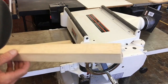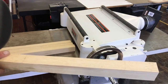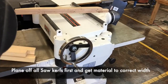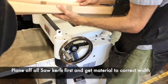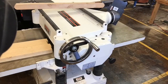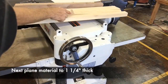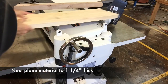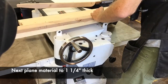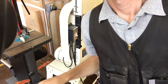As you can tell, all of these are still pretty rough. So we're going to run these through the planer and get them all to the exact same dimension. First thing you're going to want to do is plane these to width. That will allow you to draw your template on there. Notice I'm checking the template to see if it's the right width first. And then after you do the width, you can get them to thickness. We want to go for about one and a quarter.